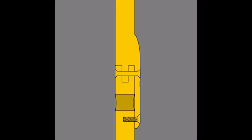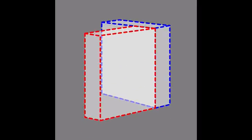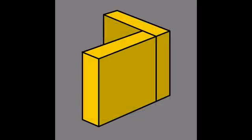The locking arm also helps support the thin area created by the cavity in the eye hook. This thin area here. The arm creates a 90-degree angle with the thinnest part of the cavity. This 90-degree angle is similar to an angle iron. The structure of an angle iron is significantly more rigid than the sum of the two planes of metal that create it. Once screwed together, the arm becomes really rigid and stable enough to support the long length of the arched arm above it, even though it contains a cavity for the eye hooks.